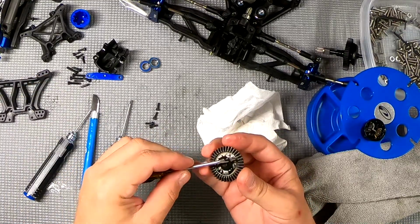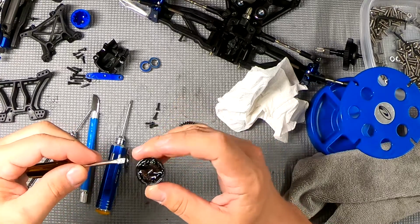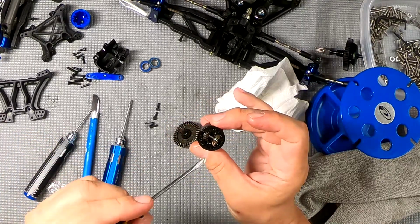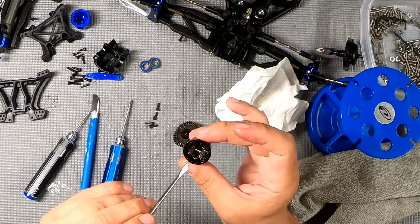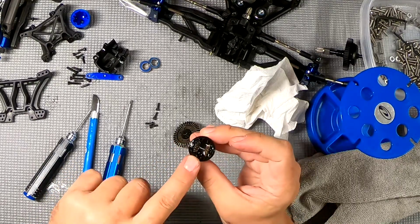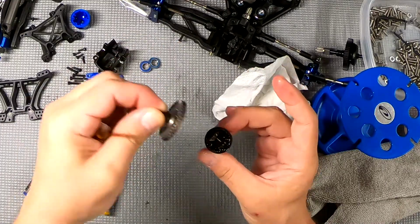So let's get this gasket. Okay, now the gasket's even easier with the stock one. You can see there's these little pins here, here, and here. And then we got our holes over there. These little rectangles right here and right here, those go in between the pins. And of course the holes go over the holes. Fairly self-explanatory. Gotta rotate that. And those little pins there and there are going to match up to these 4 little holes. They're not through holes, they're just like dimples.